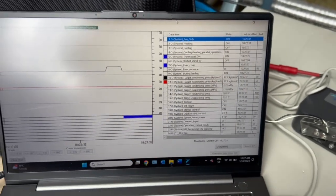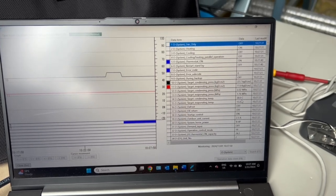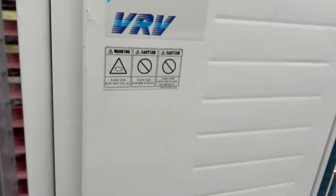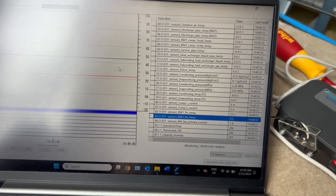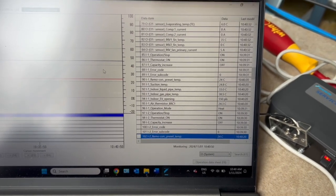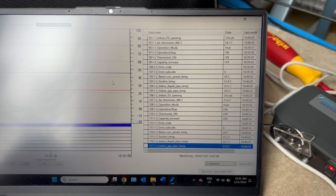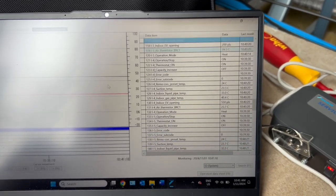System's now running in heating, as you can see there. It's only just turned on so we'll give it some time before we start looking into all of this, but we're looking good. This is an aged-care facility with a heat pump, so that's always nice - can't foresee there being any issues with that. Probably sitting around that 15-minute mark now, things are looking pretty good, starting to come in line. They've obviously got a limit of 24 degrees on the remote control - I tried to set it to 26 just to get the thing to run. A lot of them are coming close to set point and we're seeing that reflected in our pipe temps.